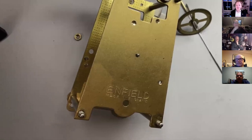Then we've got a couple of questions about escapement setting up again, which we'll deal with. We've covered it once, but we've got two people, one of whom is a new member in our Facebook group and somebody who's been asking for a couple of weeks, and I always forget to cover the subject. So, two questions. One is, if the pallet arbor and the escape arbor are too far apart, as in there's lots of drop, does that affect the duration of the clock?